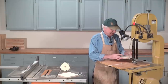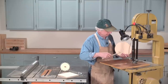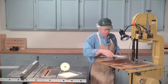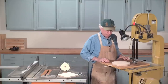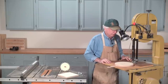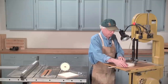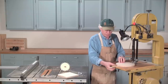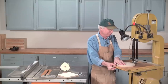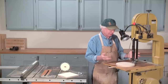Back to this pivot pin. Here's your blank — you put the square on here; it just fits. You can actually do it before you even install it in the table. You slide this thing forward until it hits the stops, and then you spin the blank just like so. You just rotate this piece and you get a perfect circle.